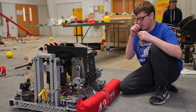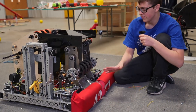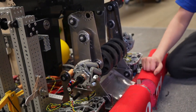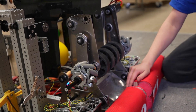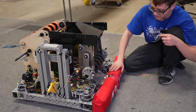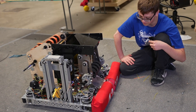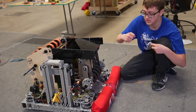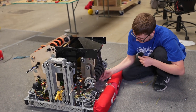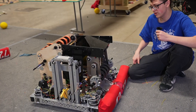There's this little polycarbonate ramp we put in to help ramp the ball up into our conveyor. Honestly, there's no real measurement to this. We cut some thinner poly carb and stacked up two 2x1 tubes and just kind of bent it in place. This isn't even properly bent — we didn't heat it and fold it. This is quite literally just resting on top, and that's held up well enough to give us a good ramp to knock the ball into our conveyor.